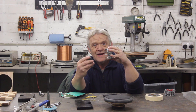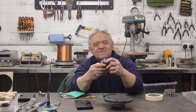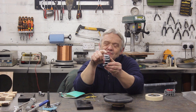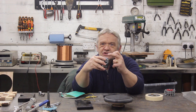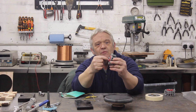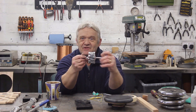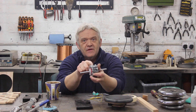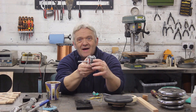Now we can take our speaker magnets and put them in the center of that, which they should just fit. What happens is the north goes on this steel plate and gets bent around here. When we put the other steel plate on, the south will get bent around to the next, so we'll get north south north south because we're bending the magnetic fields with the edge of this metal plate and these bolts. We slot those two together around the magnets, stick an axle through it, and what we've got is an alternator — it's taken that north face and shoved it there, that south face shoved there, so now we get north south north south north south from those two magnets.